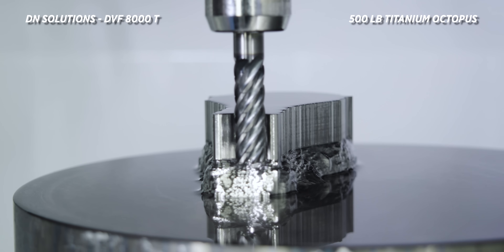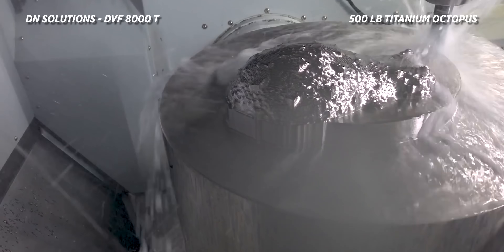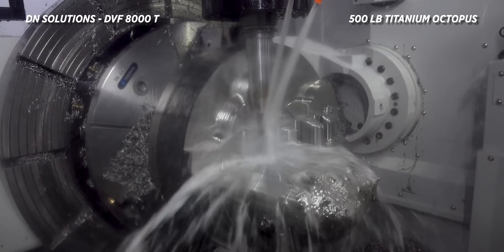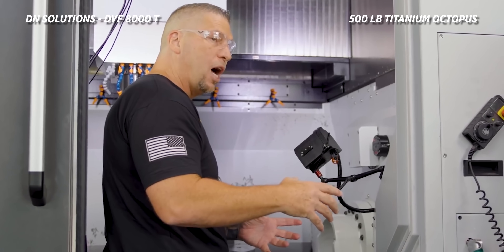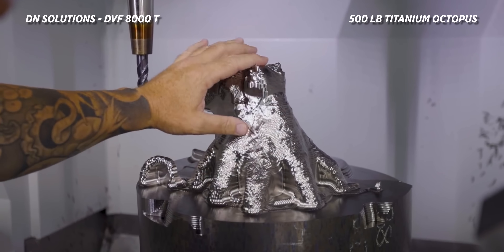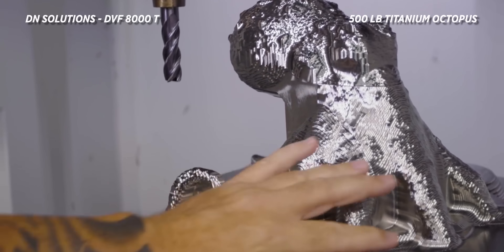So I started off with the Harvey 3, getting all the material off — boom, boom, boom — just dropped down and took some weight off of this thing. And now that I'm flipping down, I switch to a TE because I'm going to start dropping down into these pockets, and the TE is great for ramping.